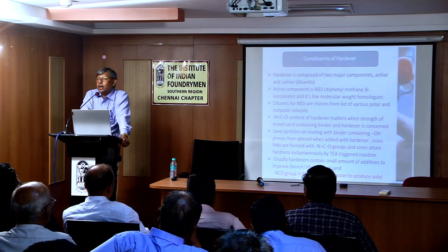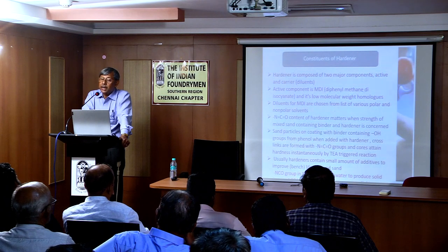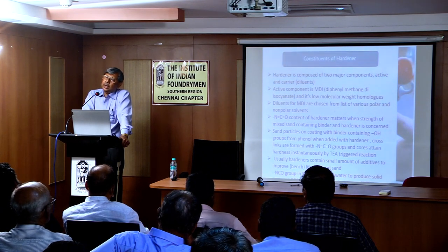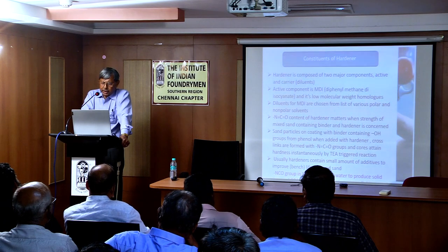So this hardener basically contains these two components, active and diluent, and to some extent some additives which act as a retardant for the reaction between hardener and resin, to increase the bench life. Particularly in summer, it is required.